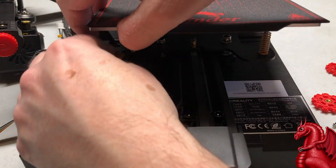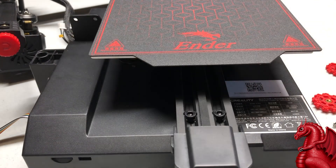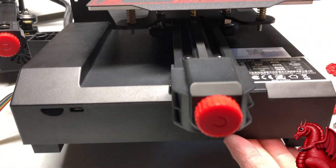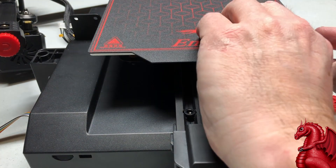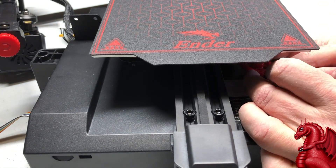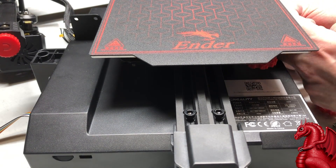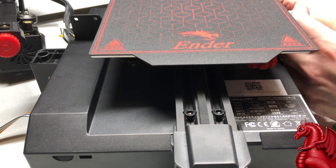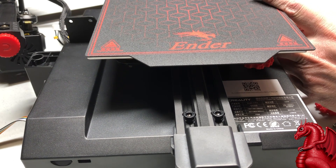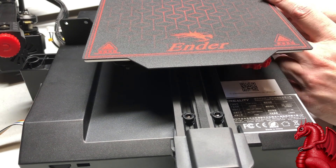Put the front springs on one at a time — fit each over the screw and put the screw back through the hole in the base mount. Once all springs are in place, reattach your bed leveling wheels. Compress these springs about halfway down or a little more so you have plenty of room for leveling later once the printer is built.